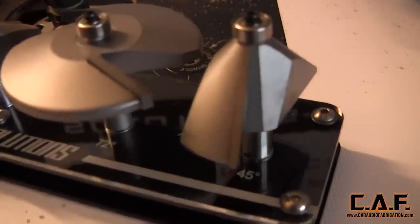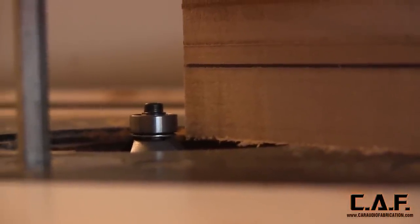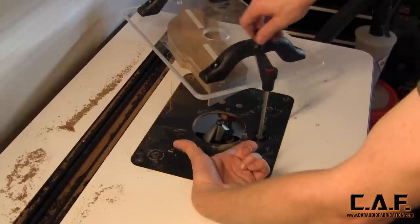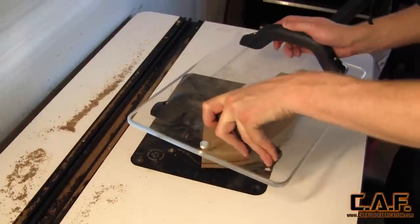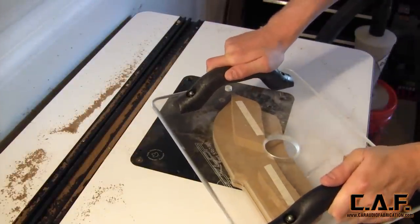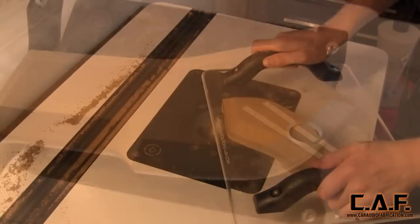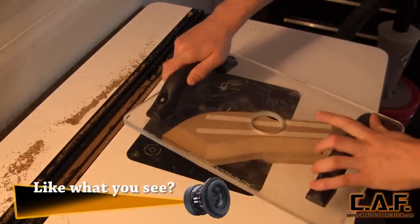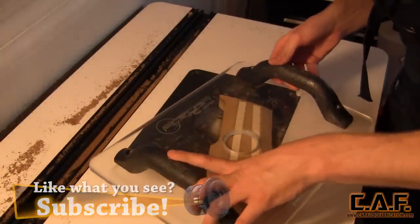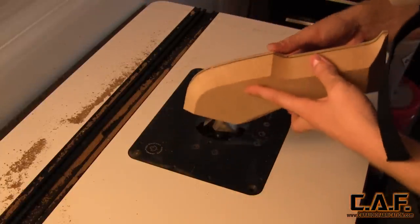We now need to add a chamfer to this piece so I'll be using a 45 degree router bit. To be precise I slightly raise the router bit until the cutting edge is flush with the bottom edge of the wood. I then count the number of revolutions in order to raise the bit exactly a quarter of an inch. I'll be making two passes in order to complete a cut that's a half inch tall. Because of the size of this router bit it's once again critical that I use proper safety. With two passes complete I now have the inside of one of my pieces that I'll be using to mold the mesh. I repeat this process by flipping over the assembly and resticking it to the router safety shield, then making those same two passes to copy this same profile onto the opposite side of the piece. I'm left with two mirror copy replicas that have this chamfer, and thanks to the quarter inch piece in between I was able to maximize the chamfer on each of the two pieces.